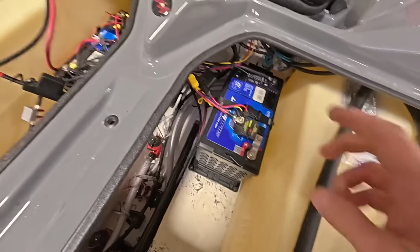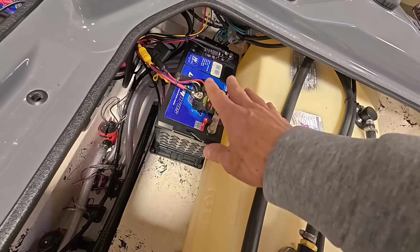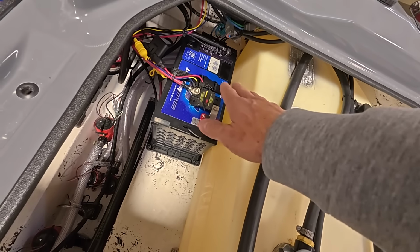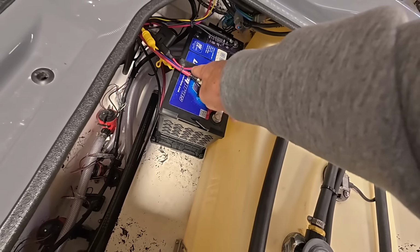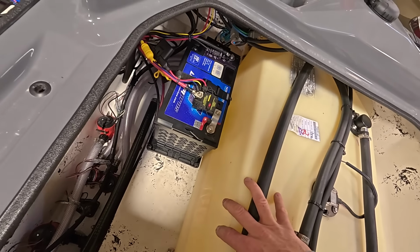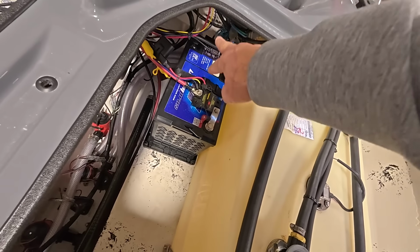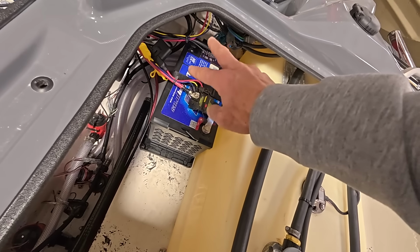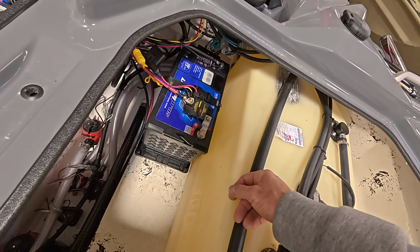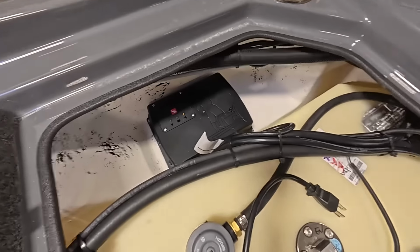So we've got the big 36-volt. This is the 75 amp per bank battery on a 36-volt battery right here. And as you can see, those big lines right there go right to the trolling motor, right to the front, right to that Power-Pole Move, and then those smaller wires right there, all 3 leads for the trolling motor side go to the single 36-volt lithium coming from the Power-Pole charger, which is mounted over here. Got that mounted over there.